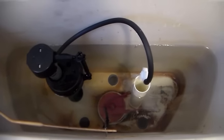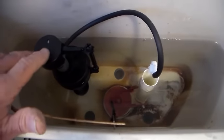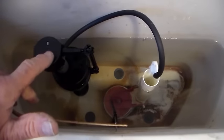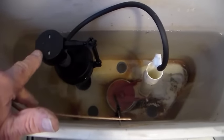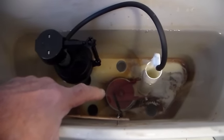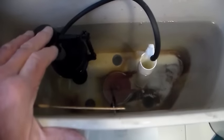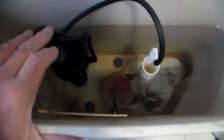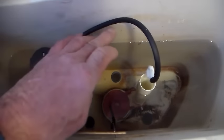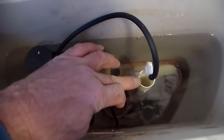Now you look inside the tank and you see what you see in most toilets. You see the fill valve over here, which there's about three or four different kinds that you'll find in the toilet. This one happens to be a Fluidmaster. And down there is the flapper valve, which lets a maximum volume of water go into the toilet in one big burst, so it flushes. And then some of the water at the same time comes from the fill valve through this dark tube here, and goes over to the standpipe or overflow.